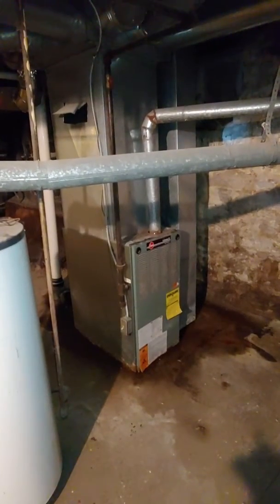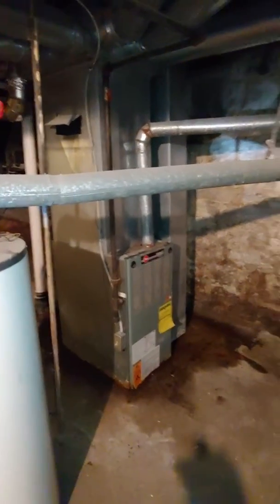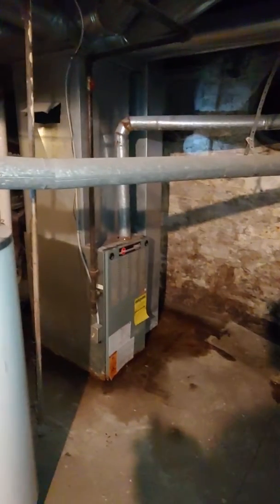We're looking at the indoor unit. No air conditioning, and we aren't going to be putting in any air conditioning. We do need a flue liner — it's going to be a two-story, and I'll go up to the top to see how long it's going to be. Unfortunately, we can't do a 90% because our water heater is feeding into there, so we're just going to come back with a flue.